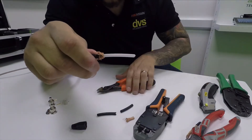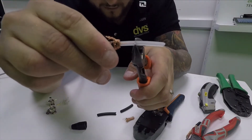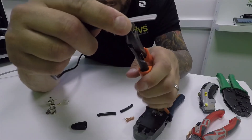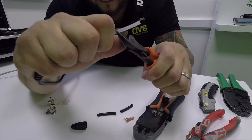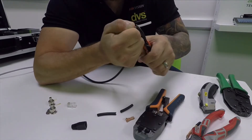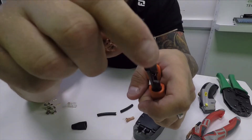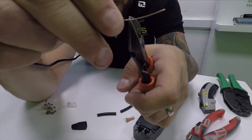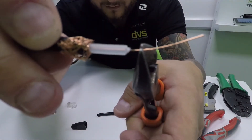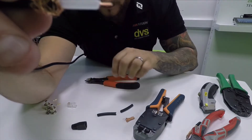Then again with cutters or a Stanley knife, go about that far in from there — nibble one side, compress, turn, and pull. Hold it nicely and pull. You'll want about that much of the copper on the end — let me move my finger — about that much copper there on the end. Cut that off.